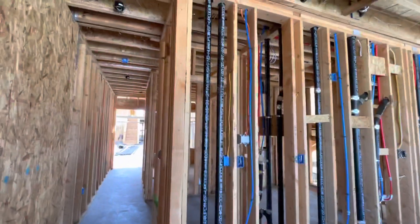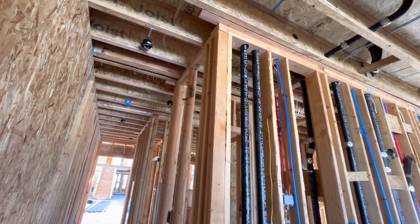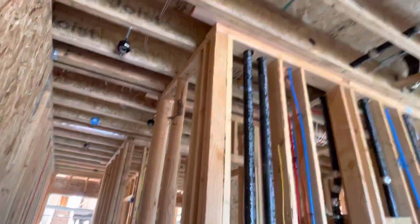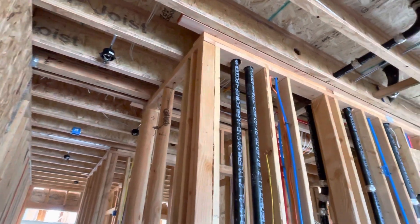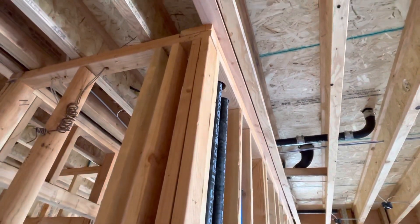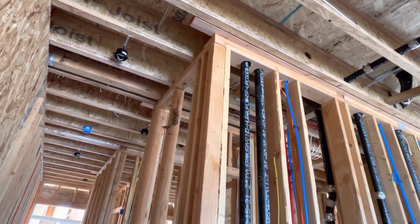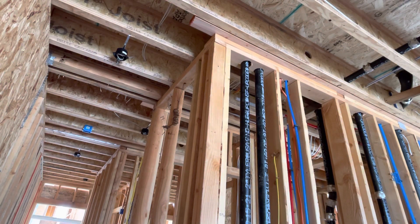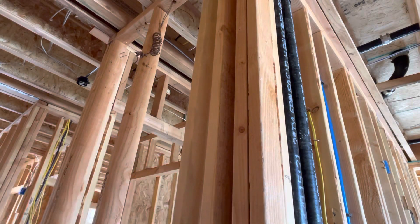You can see here how the top plate has been lapped. Let's go into this corner right here. Look up top — to the left of the black pipes — see how it's lapped? California joint — there you go. You can stack a few pieces like that, just pack it in. You could even put another stud in that corner, or a two-by-four, because that will stiffen up this corner. You wouldn't want just one two-by-four there, but you could pack all of this in as well if you wanted it even stiffer — not a problem.